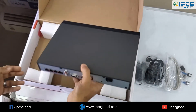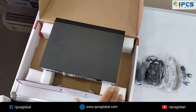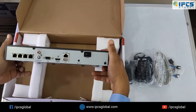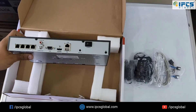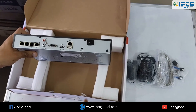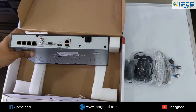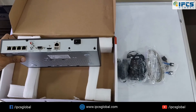For small-scale projects — for example, if you are planning to install four PoE cameras — you can easily use this NVR because it doesn't need any separate PoE switch, which is itself an advantage. It has a single SATA interface, meaning only one hard disk can be installed, with a maximum capacity of 6 TB.